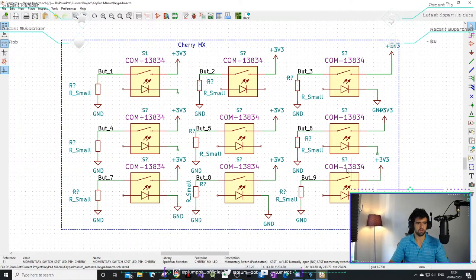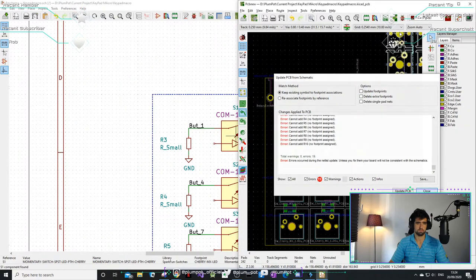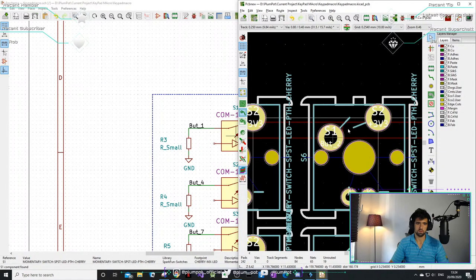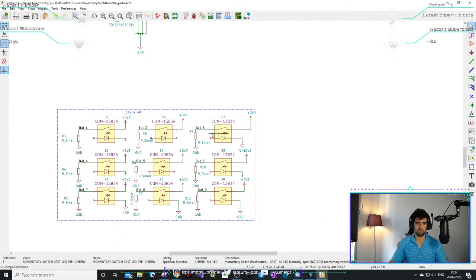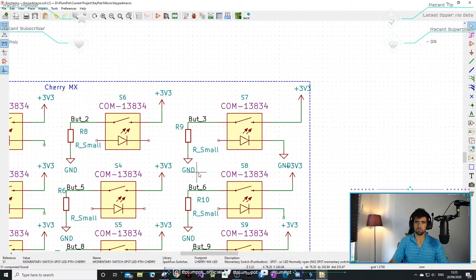So yeah, so it's a built-in key and LED. I'll just show you, it's maybe easier to show it like this. So you can see that it's got a switch and an LED. If that makes sense. I'm trying to think how to explain it. So when you push the button, you're going to make the signal on the controller high. But when you don't push it, you want to make sure it's zero. So that's why you pull it down to zero. I'm going to add a capacitor probably as well for debouncing of the keys. I don't know if it's really necessary. But so it's two separate circuits. You've got the LED and the switch. They look like one symbol, but you need to ground the LED. So we're going to put some voltage here to put the LED on. There's no stupid questions.